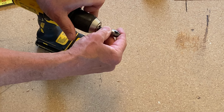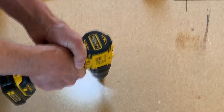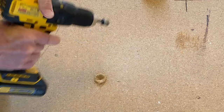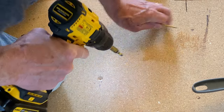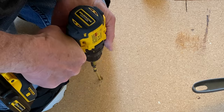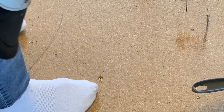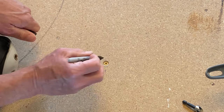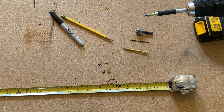I bought this new countersink to speed things up instead of using a separate drill bit — faster, more professional. Put some weight on it. It went down pretty quickly; I hope it wasn't just hitting air. No squeak! I recessed it a little too far, but I took care of the squeaks here. I was a little bit off where the joist was located, so I added a couple more screws a bit further and that seemed to take good.